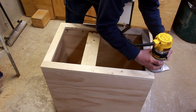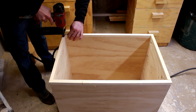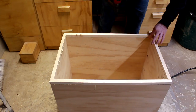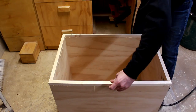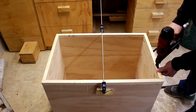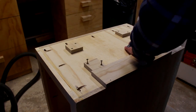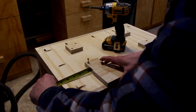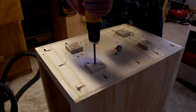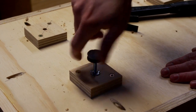I made the frame just a little larger than the length of the cabinet so I could then flush the edges with my router. I repeated this process for the front of the cabinet as well, making the frame the same thickness as the plywood to cover up the exposed end grain and extend the cabinet length a little further — you could use edge banding here as well. I flipped the cabinet over and attached four plywood risers so the cabinet wasn't too close to the ground, spaced away from the edges so they won't be seen. I also drilled four holes in the center for shelf leveling feet with cloth on the bottom so they won't scratch the floor. Finally I made a two inch hole that will allow the power strip plug to fit through.